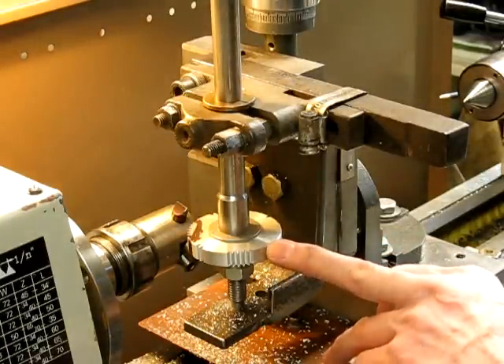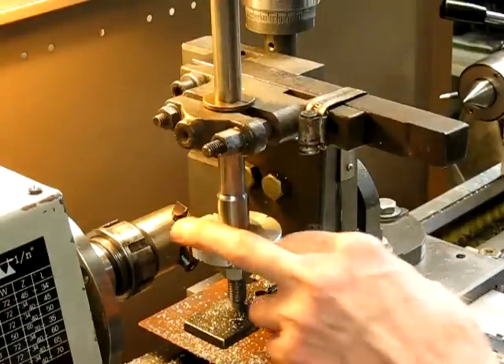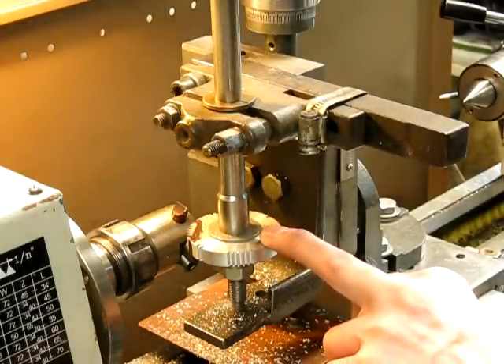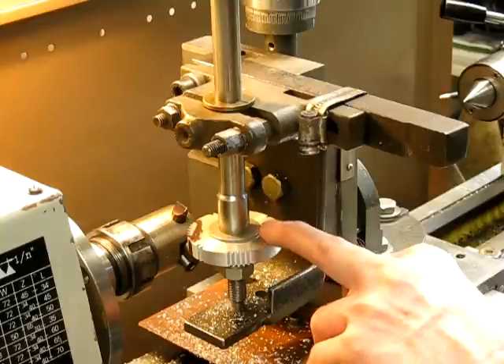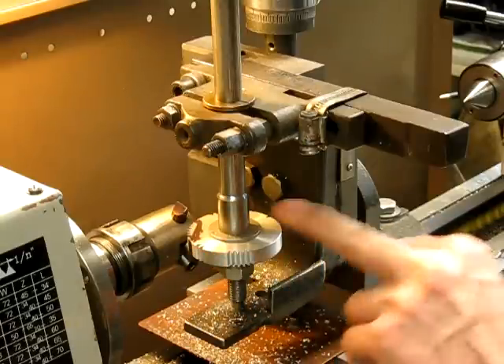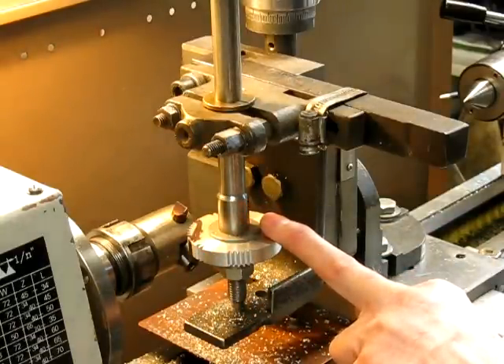It's certainly quite easy to cut gears very cheaply. Even this blank is made from scrap aluminium that I melted down in a tin can using a hairdryer as a bellows for a wood fire — it's as simple as that. So the whole gear can cost you absolutely nothing.